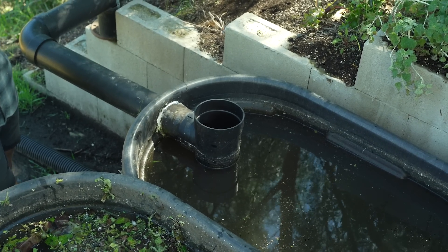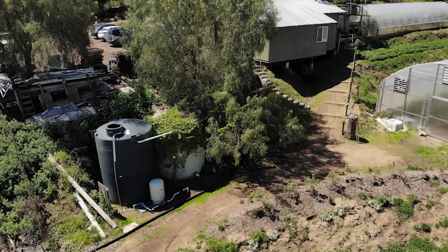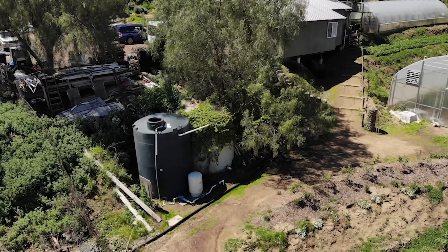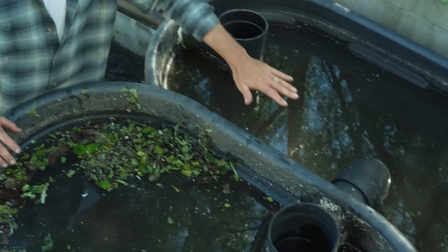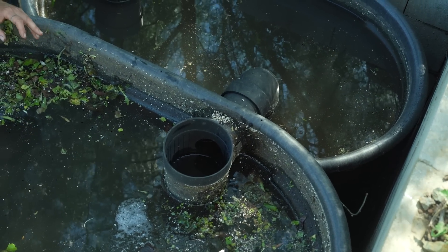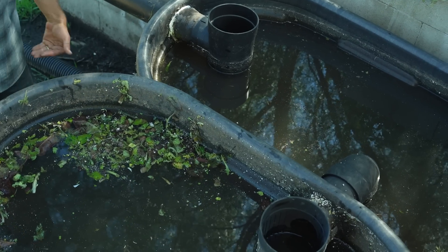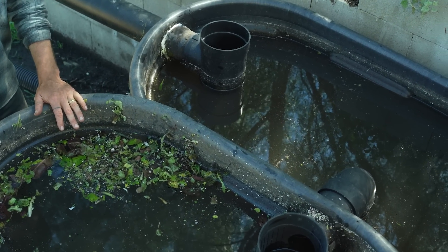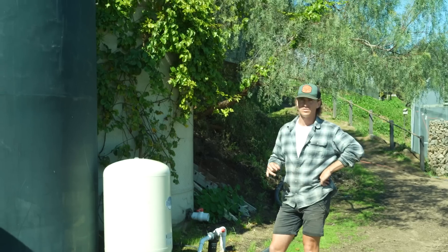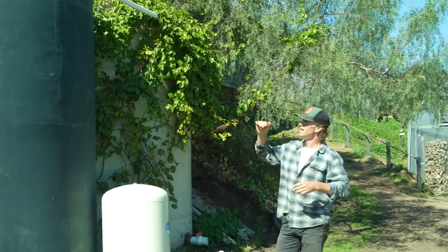There's about a 10-inch difference in elevation from the bottom of our wash pack facility to the top of our tank, and then from there it drops 15 feet to where the tanks are placed. I thought it was important to show this transfer because it took us a little bit of a learning curve to figure out how to keep the tanks from clogging and overfilling. If you drain the 100-gallon tanks too quickly, this tank can still overspill, so you have to release it slowly — it takes a little time.